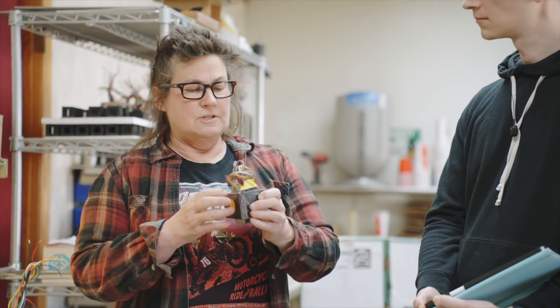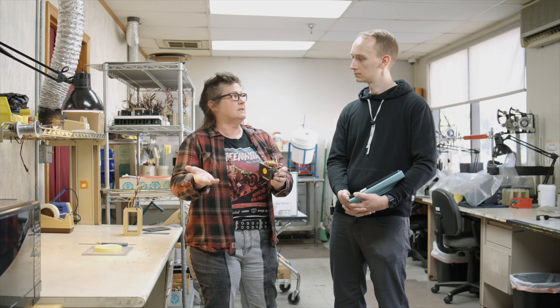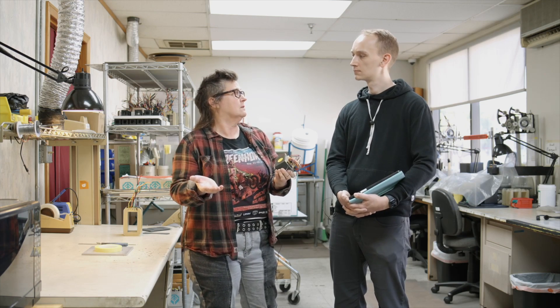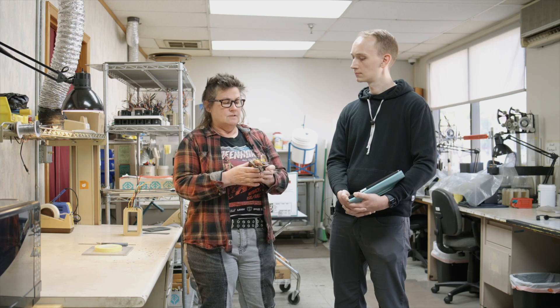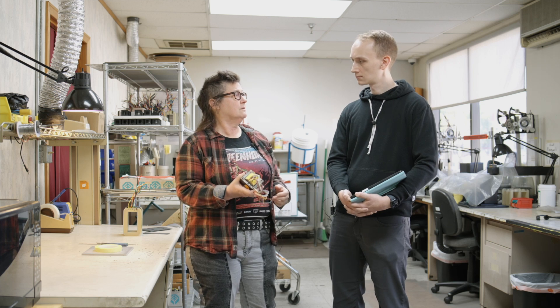It's working the impedance — it's kind of like resistance, but it's got other factors involved, but we call it impedance. The impedance level, maybe you're working at — I'll just make up a number — like 4,000 ohms or something. And then the transformer has to transform that 4,000 ohms and reduce it to, say, 8 ohms for your speaker or 5 ohms or whatever. So it has to transform that impedance down from thousands of ohms to something your speaker can deal with.